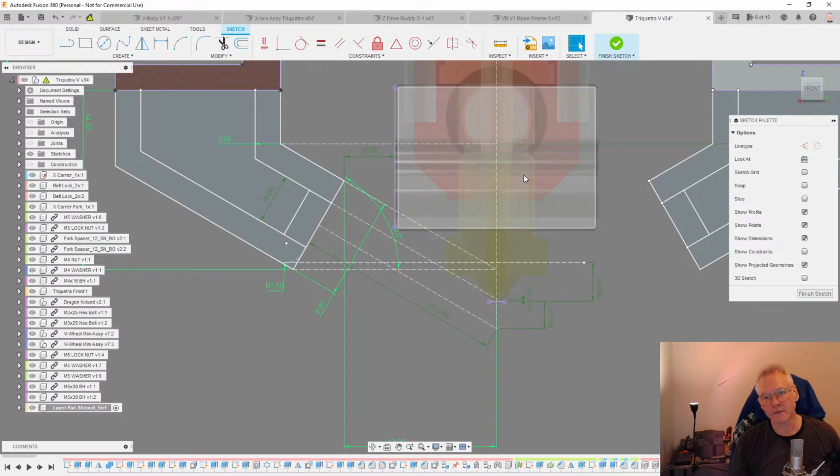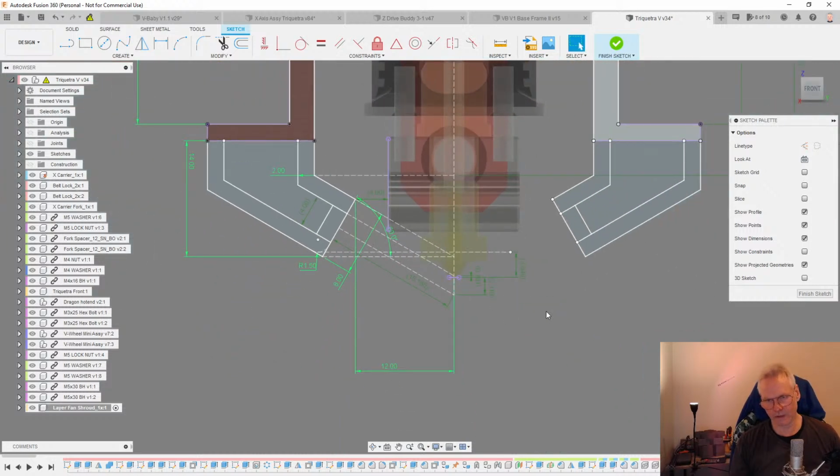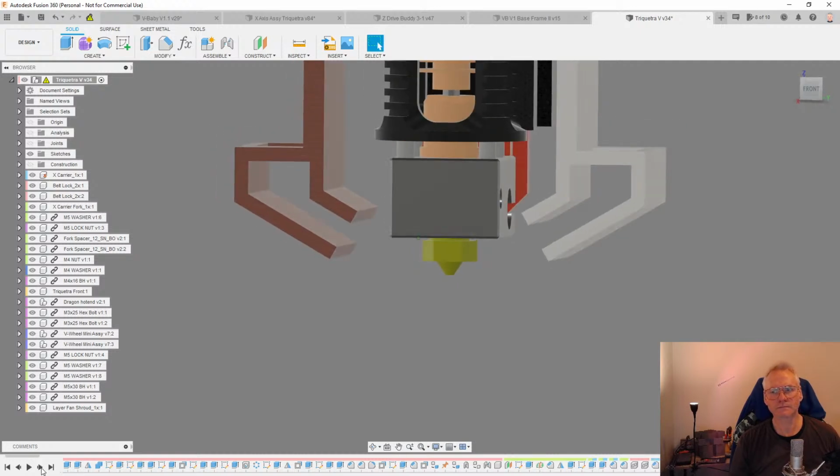And I think we have a good angle. We also have 4mm space to the heat block, which should be okay. Let us try and see. You don't use a sock. Why don't you use a sock, Andy? I don't have the option to run simulation, airflow simulation. I don't have a license for that.